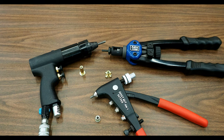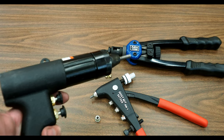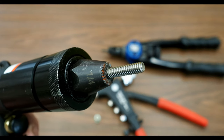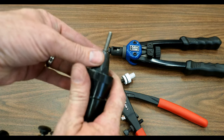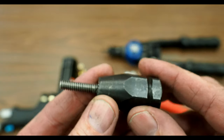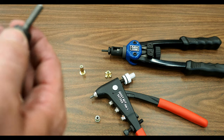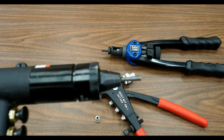The last tool we've got here is a Pneumatic PlusNut setter — this is a really slick tool. I borrowed this from a friend and I've been using it on my van build. This thing sets PlusNuts perfectly straight every single time. The mandrel on this particular unit is just a standard quarter-20 bolt available at any hardware store. If you pull the quick-release collar back, you can see inside — that's just a standard Allen bolt. So if you're going to do RivNuts or PlusNuts, you can just go buy a nice stainless steel bolt, whatever length you need. If you mess the threads up, you don't have to buy expensive repair parts — just click it back in and you can fix it at your local hardware source. That is really nice.